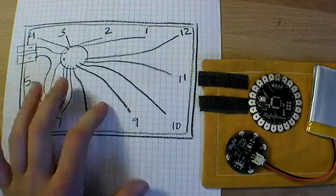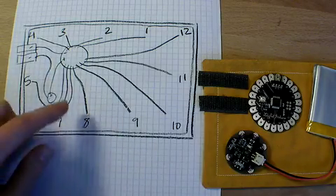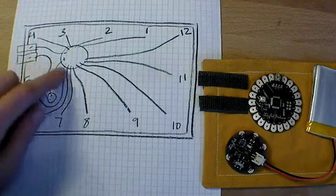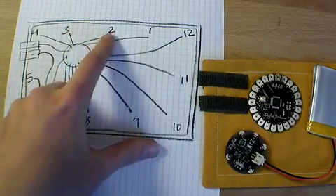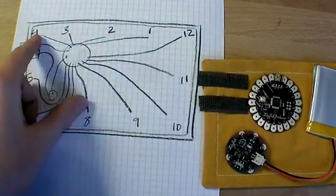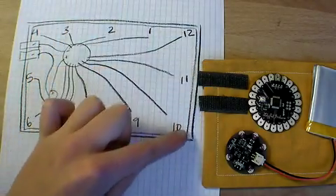Here's a diagram I drew out for determining where the LEDs will go. You can download a computerized version of this in the blog post with the source code. Basically the LilyPad is here, and each of the digital pins is connected to one of the LEDs, and then the other end of the LED is connected to this ground wire that goes all the way around the outside.